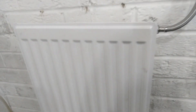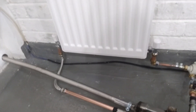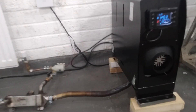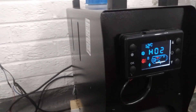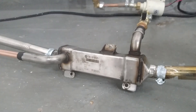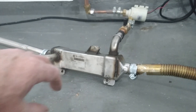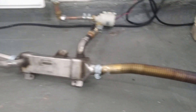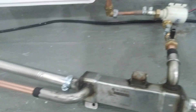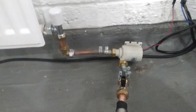I've left this end open - on my last experiment a couple of people pointed out that you need a bit of a breather or pressure release valve, otherwise one of the joints will pop off. So I'll just leave that open; it's a low-pressure system so it should be okay. We've turned it on again - only on heat setting two, goes up to number six. Apologies, I still haven't got the non-contact temperature gun - the wife plays with it with the cat using the laser. But that's already red hot, travelling through there nicely. I'm going to get the pump switched on straight away.